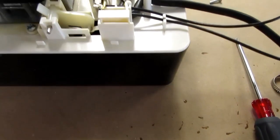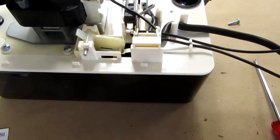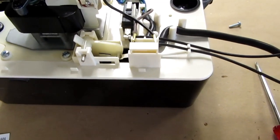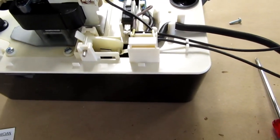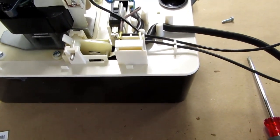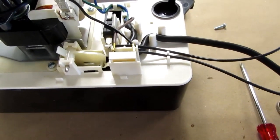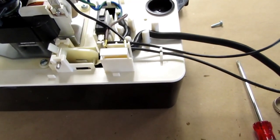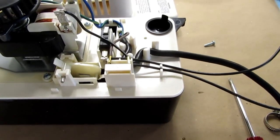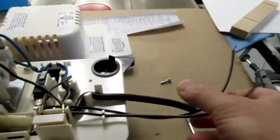For alarming a high level, you want something loud enough that you can hear it and something readily available. One of the first things that occurs to me is you can just go to the hardware store and buy a traditional doorbell, and those are usually transformer operated. So you buy the little doorbell transformer, you buy the doorbell, and you wire it up according to the instructions, just the way you would for a normal doorbell, except instead of the switch by the front door, you wire it up to these two wires.